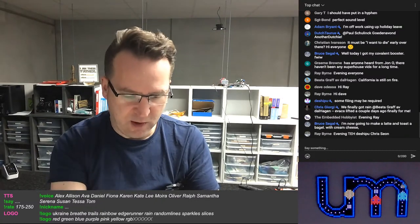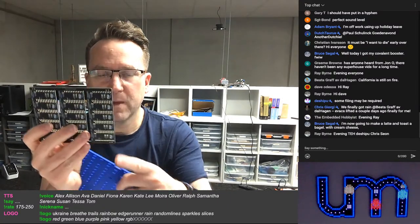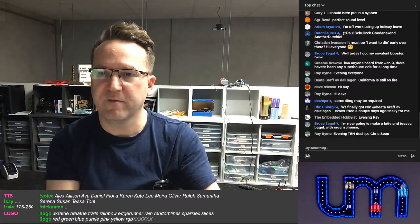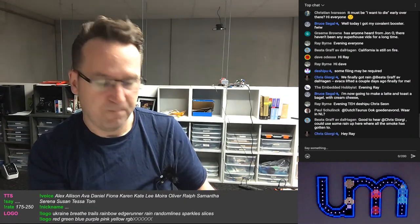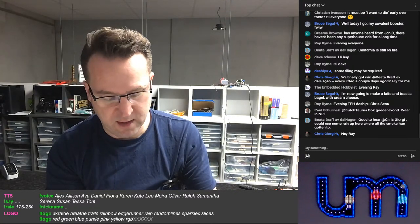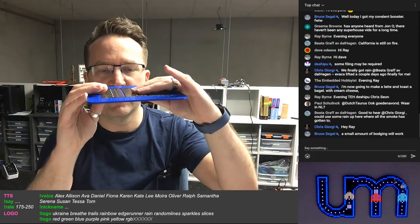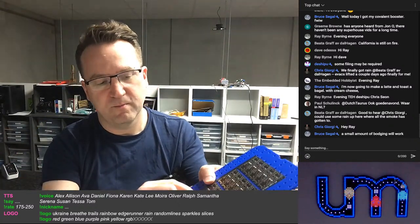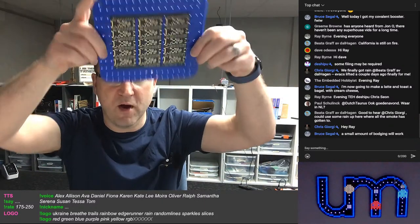And it looks like on this edge just here, there's a bump. And it's making it slightly out of tolerance just on that side. Anyway, I can fix that. I don't have to reprint it. I can just take a knife to the section. I mean, it does fit. It goes in, but it gives it a slight bow, which gets pushed down when the vacuum happens. I just need to take the knife to the edge of the 3D print. Anyway, it goes in. It's fine.